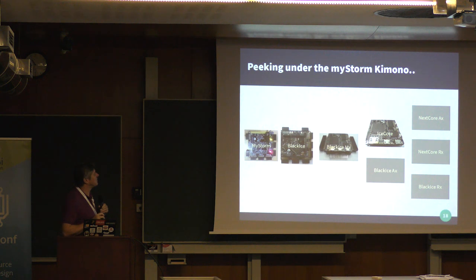Here's where we are. We had the original MyStorm back in 2016, then the Black Ice, going up to Black Ice 2, and this year using BlackEdge we produced the Black Ice MX. The Ice Core continues going forward. On the low end we'll probably see a lower-cost Black Ice AX, and then an RX which is RISC-V based. On the Ice Core side, we've got AX variants based on the ECP5, using either the STM32F7 or H7 at 400 MHz, and plans for a RISC-V version using the 100-pin GD32V103 from GigaDevice.